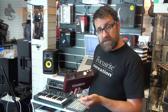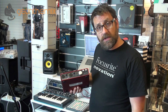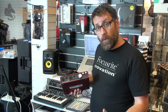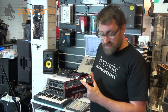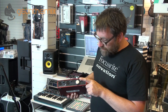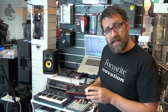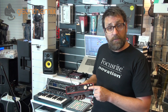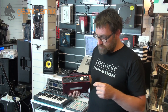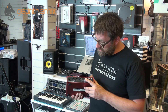We can plug microphones or instruments into the front panel here, and if I want to plug in a microphone that uses phantom power such as a condenser microphone, I have a switch on the front which will turn on 48 volts, delivering what is required by the microphone in terms of power. We also have a nice big control here for the volume, which is controlling the output to your speakers, and we have two headphone outputs with independent headphone volume control. This can be set up to send a separate mix from what we're feeding to our speakers, so we could have a performer in another room with their own headphone mix while we listen to our main mix out of the main monitor outputs.